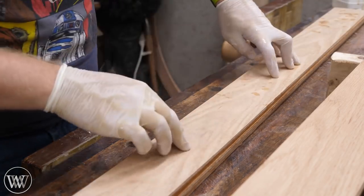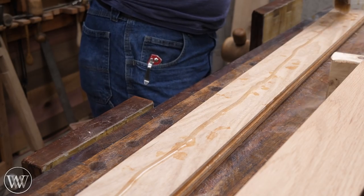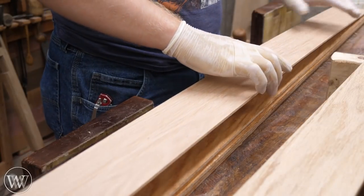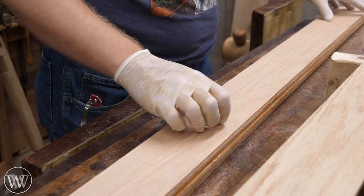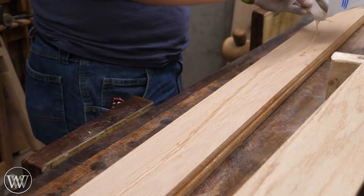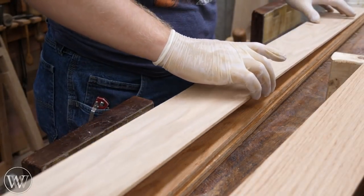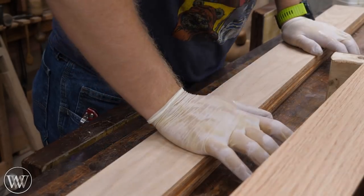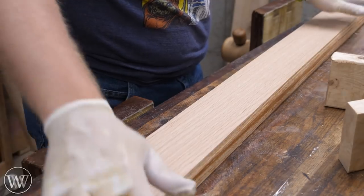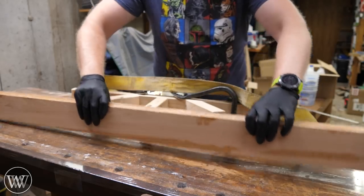In total it will end up being about an inch and a half thick with that eighth inch line running through the middle. Continue on - spread more, pile it up nice and thick, put the next layer on, spread another layer and keep going. Just remember when you get to the last piece, don't put epoxy on the last piece because you don't have another piece to put on top of it. You want to be careful because it is going to take a little bit of time - make sure everything is nice and clean and straight, and that you're getting a good clean surface.